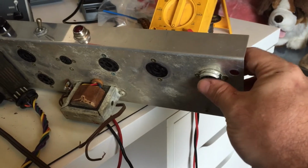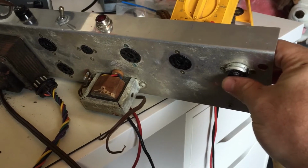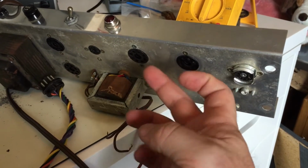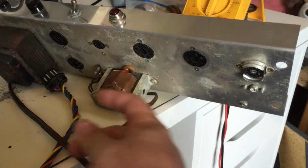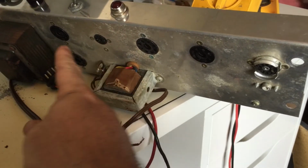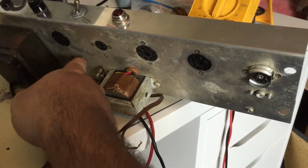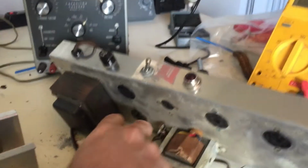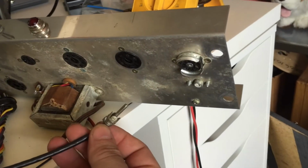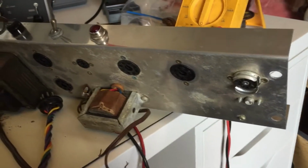On this side, once that signal makes its way down, before it gets amplified, it goes through the preamp, this phase inverter. It gets split, and then it goes to these 6V6s, and then this is a separate circuit that provides that other thing that we discussed, the tremolo, the vibrato, and then these are the output tubes. This is the rectifier, and this is not a tube. This is that socket that connects the bottom of the amp to the top of the amp, and then there's a dedicated line, like I said, right here for the actual signal that rides separately. So that's as much as I've discovered right now.